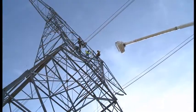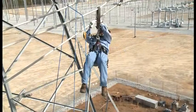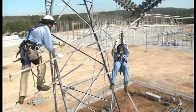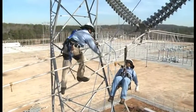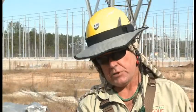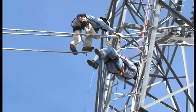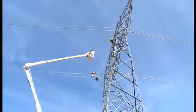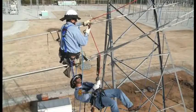If something happens where the man is up on the wire and he has a medical condition — meaning he fainted, heart attack, stroke, any kind of medical condition — there are two different scenarios. In one, he's been dropped off on the wire, he's belted in, and he's moving towards the insulator when some issue happens. What we do is bring him out 12 feet away from the tower so that when we drop him down, he doesn't become like a spark plug between the wire and the tower.